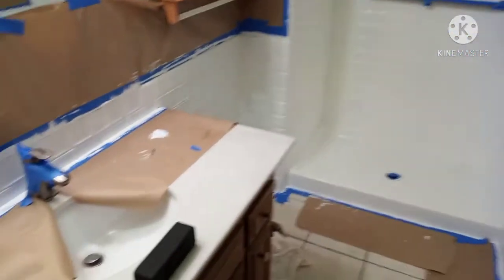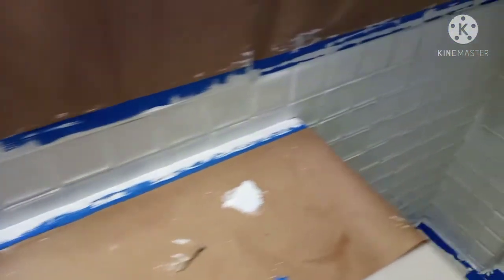So like I said, here's those details that were spots where it wasn't adhering properly. After doing a second coat, they were still kind of like this, and I ended up going over it additionally later, because as I would try to do it when it was still really wet, it would just keep creating the same thing. So what I ended up having to do was put a coat on there and then come back the next day and put another coat on over it, and then wait a few more hours again, and then do it some more, just in spots where it was doing that, not the entire thing.